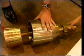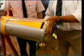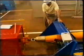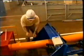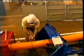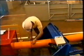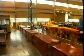To allow attachment of the winch wire to the polyethylene pipe, a mechanical nose cone can be used. This requires removal of petals marked off using a simple template. Full pipe samples are used in the evaluation. The test rig consists of a die holding frame and a hydraulic winch with calibrated load cell. Fine control over rates is possible during the pull.